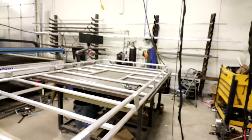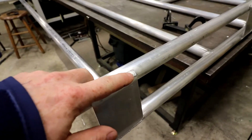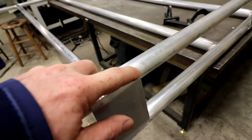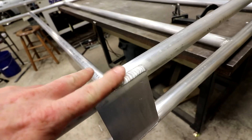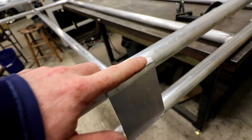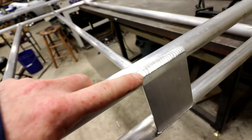The hotter the piece of aluminum, the nicer it will flow compared to when you initially start. If you're wondering how I got these welds so consistent, the trick is you've got to weld twice. You lay your bead down the first time — welding right to left — and it's cold, so the weld is narrower and beads up higher at the start. By the time you get to the end, the heat pushes it down wider, so the bead is inconsistent from one end to the other.